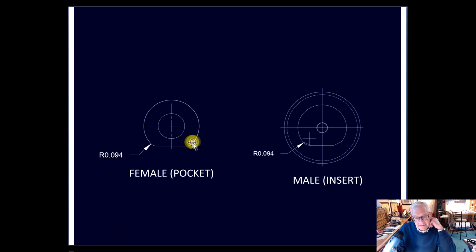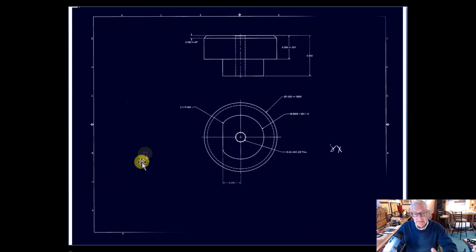Let's go back to the D-shaped holes. We have the D-shaped hole which is going to be the female pocket, and then I've got these inserts that go in there. The toolmaker in me, who has put things together many times, knows the first problem is going to be these radii in the corners. The radius in the corner of the pocket is called out at 94 thousandths — 3/32nds — and the same thing on the insert. I whacked that right off. I have to machine this flat anyway, and nobody's going to see this — the head is going to cover the hole. You could just chamfer that right off and not have to deal with it.